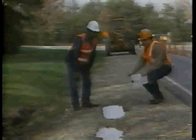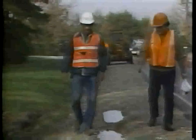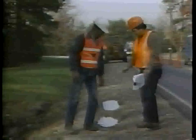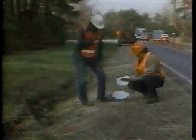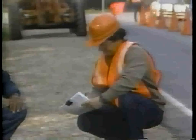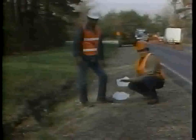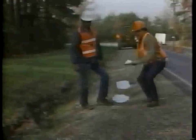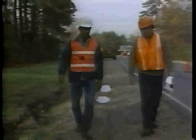Reshaping is done when there is very little erosion on the shoulders, and there is enough material to allow re-establishing the correct shape. If new material must be added, another activity called replenishing shoulders will be required. If necessary, schedule cleaning and reshaping of the ditches during this operation. Good drainage is essential for a long-lasting repair. Refer to the IRF videotape on cleaning ditches for further information.